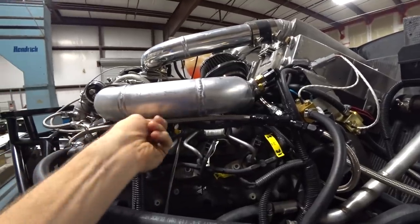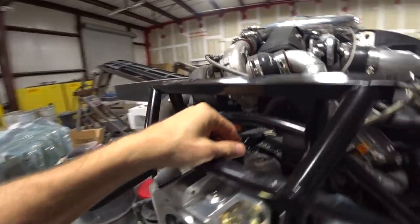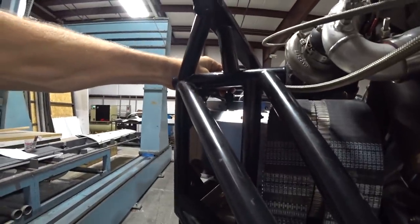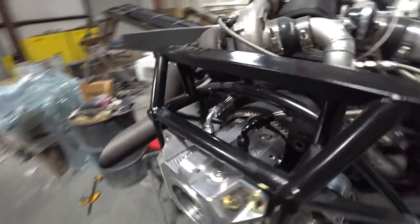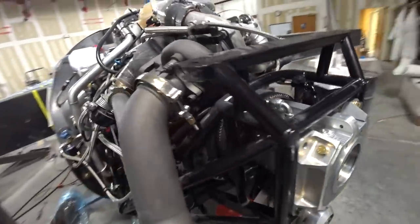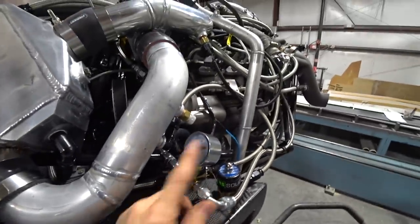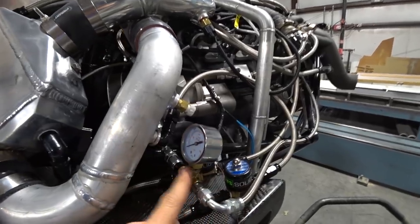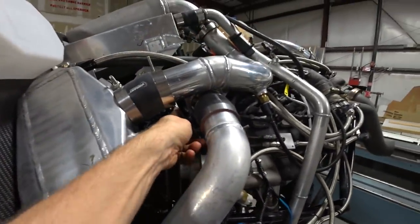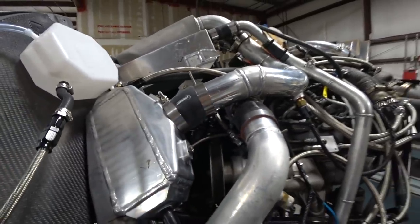This is the line coming from the main oil feed of the engine going to the re-drive — you can see I've got the re-drive temporarily bolted in without the shaft. That line will basically live there; it's not permanently done yet. The other side is the high-pressure feed from the governor that runs to the prop. I've also kept a pressure gauge in here reading up to 300, positioned so I can read it from in front of the wing when we run it later to verify the governor is working correctly.